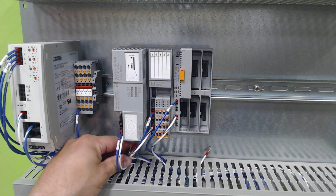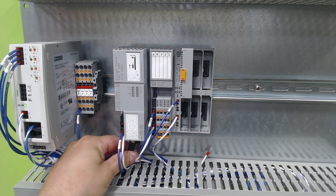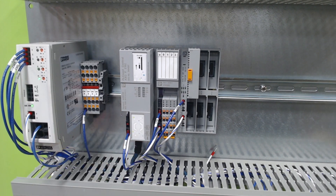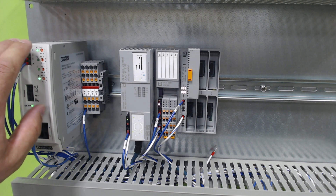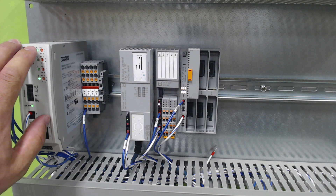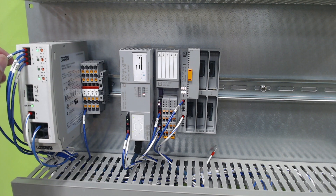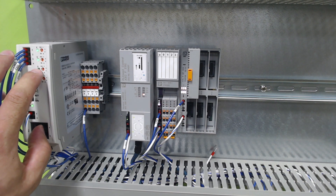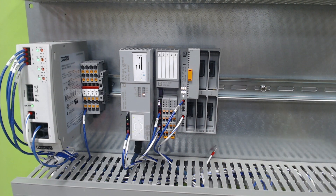The Ethernet cord will go into the bottom here. Now we're electrically connected and we can go ahead and turn it on. If we turn on channel one, that's going to be your PLC. If you turn on channel two, that's going to be your I/O card. And if you turn on channel three, that's going to be your smart element base. Let's get started.